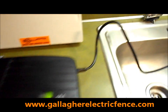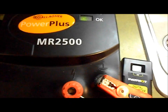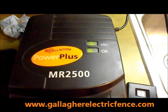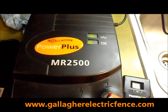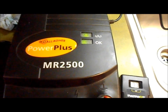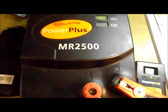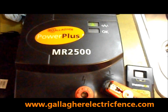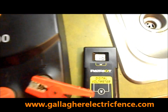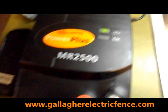The secret here is to keep it on a surge protector from your outlet — make sure you put it on a surge protector. I think that's probably what caused the problem: this unit is from a ranch in New Mexico, likely at the end of the power line, and it had a power surge that went out to the barn where the fencer was. For about five bucks at any hardware store, you can buy a surge protector and put your energizers on it so this doesn't happen. This unit is ready to go — we're going to ship it back to the customer in New Mexico.